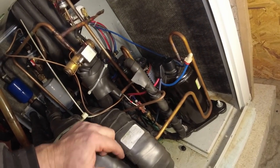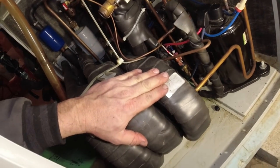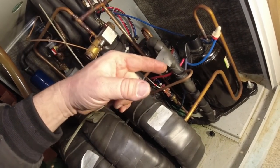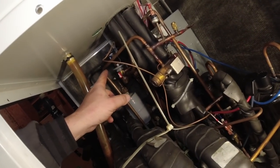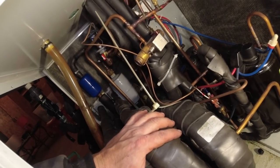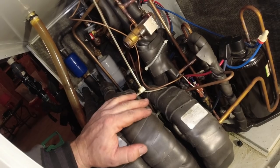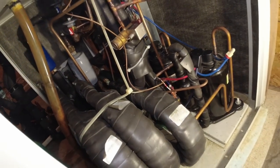They'll circulate back and forth to the water heater, then it'll come to this one - kind of like reheat. You've got the same components, you just can't make it out to be more than what it is. You've got a compressor creating flow - hot gas coming either to the coax coil, out of the coax coil, to the TXV and into the evaporator. Or if it's summertime or wintertime, hot gas goes straight to the evaporator which is now your condenser, comes out, goes through the TXV, then to the coax coil back to the compressor. Just a basic refrigerant circuit.